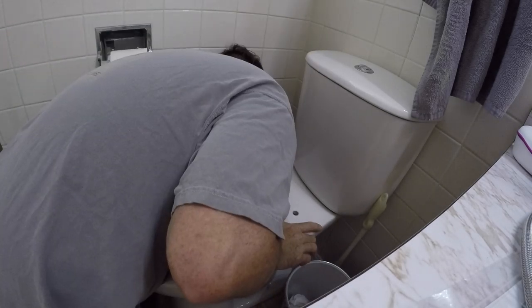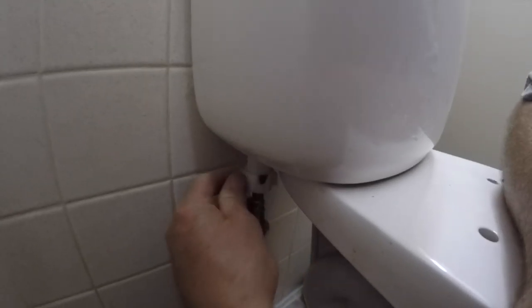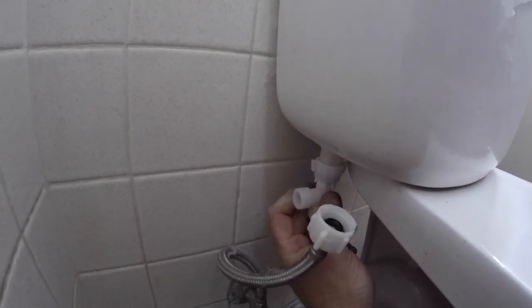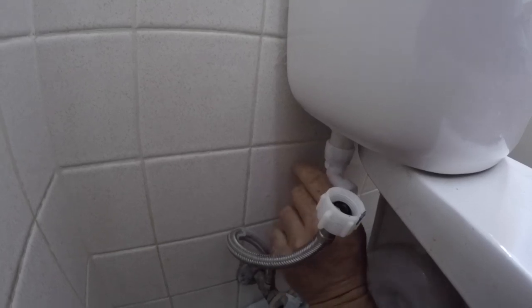Now what we need to do is take off the valve down here. We've got to remove this fitting — there'll be a little bit of water coming out, but good way to clean the floor. Throw a towel down there to catch the water. Now this T-valve goes on like this — it doesn't really matter which direction, we'll adjust when we need to. Then the original water line connection goes back on here like so.